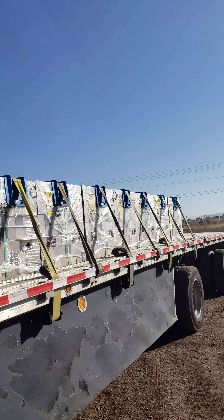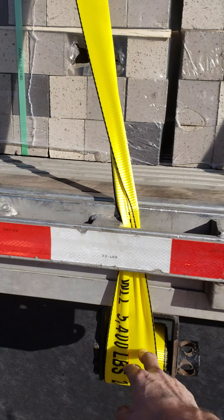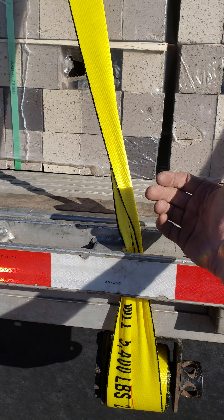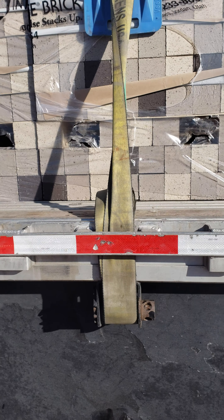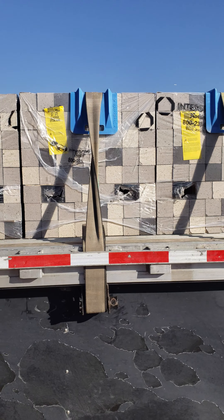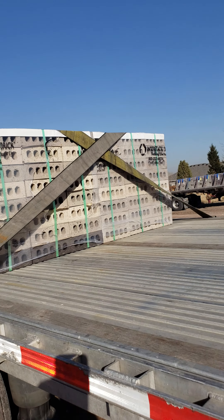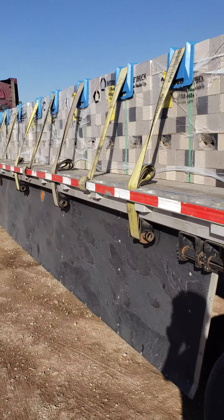I didn't put corners on the front because if you look real close there's already cardboard corner protection on the pallet — corner protectors all the way down. I did the excess like we normally would on this one, but I rolled it all up in there on this one, because once you tighten these they get really skinny and they just won't hold the excess like the wider ones will. We've got a strap over each individual pallet — there's 22 pallets, so 11 straps, plus two for the crisscrosses.